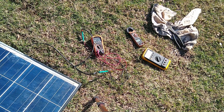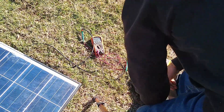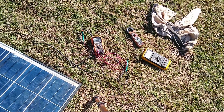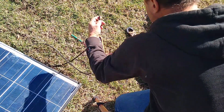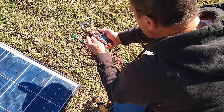That's not too bad for this time of year and less than optimal conditions. You don't want to leave the multimeter hooked up too long, otherwise it might damage the resistor in there. So just do a quick test like that. Now let's do an actual short circuit test using a clamp meter.